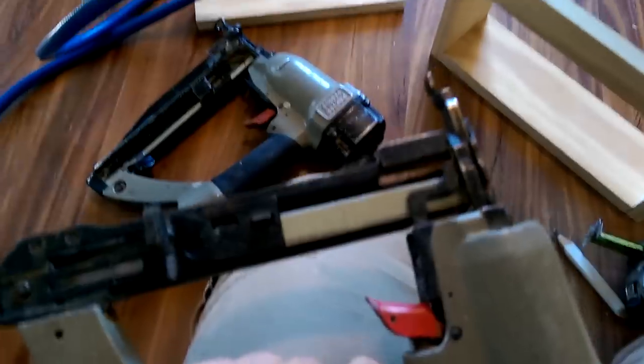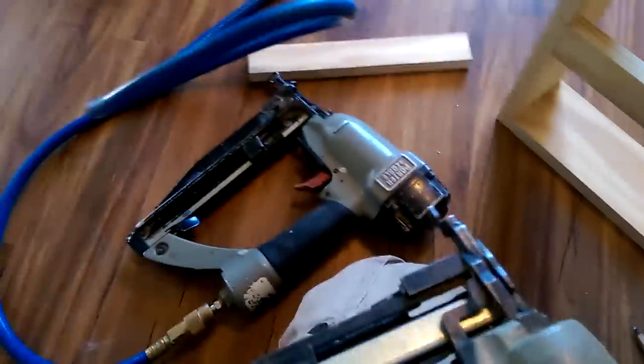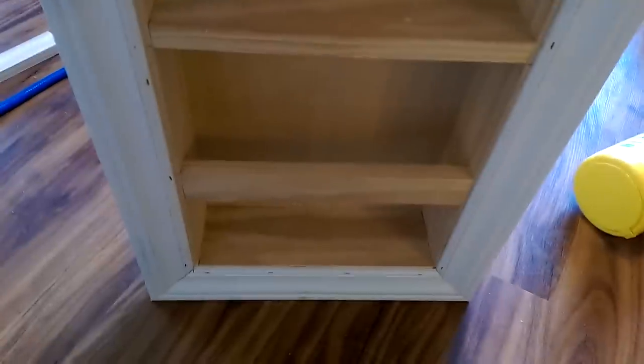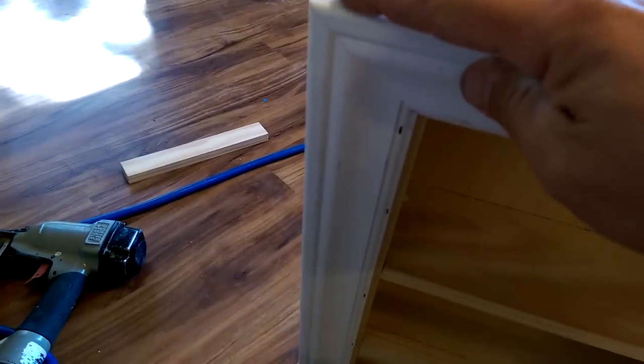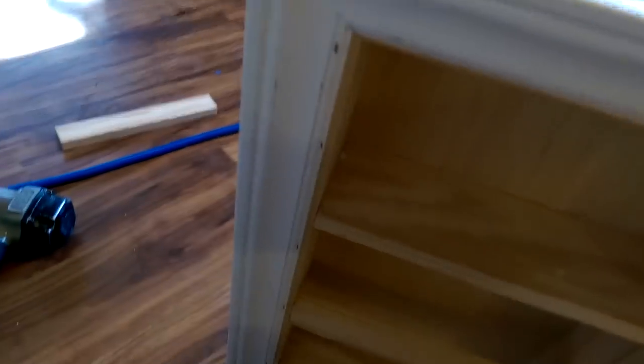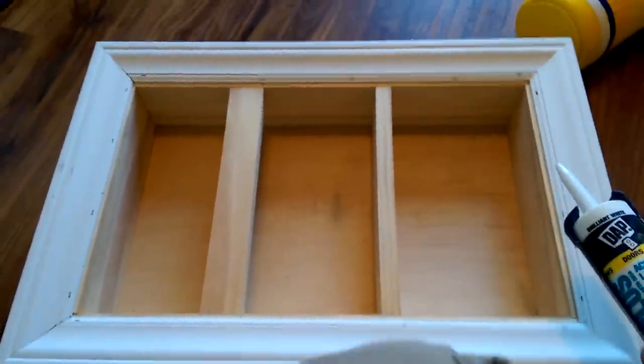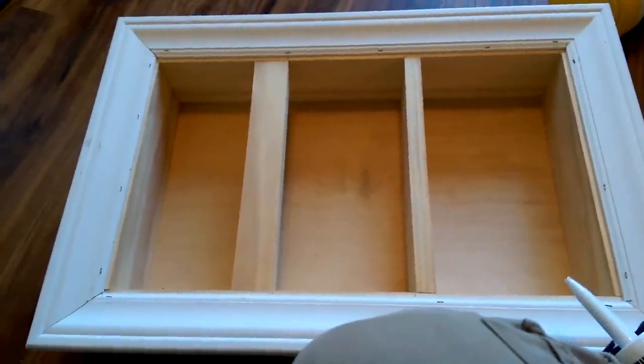You can use hand staples or small nails for the nail gun — you need to have it, and I happen to have it so I use it. I'm going to do that and put the trim around it. As you can see, now with the frame around it and the back and everything, it looks really cool. I used staples on the casing to put them together and inch-and-a-half nails to make the frame nice and strong.